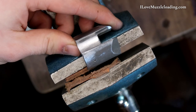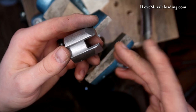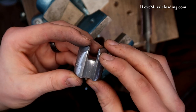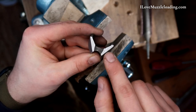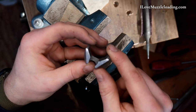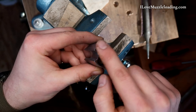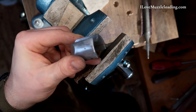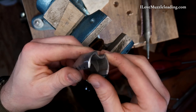I'm going to take care of this off camera and then we'll move on to our next part. So after I cleaned up my nose cap here, I had a few details I wanted to show you — things to consider that you might want to clean up on your parts. I have some rough, nicked edges here from working both sides — you can see right there, we have kind of a gnarled file mark along here. Along our front here, this is going to be visible from the front of our muzzle, so we want to make sure that we're polishing and cleaning up this front face as well. Right now it has just preliminary grinding marks from the factory where they've probably removed some casting gates. I want to flatten out this face between these two ridges, and I'm going to clean up this bottom face too, even though this goes into our stock. I also want to chamfer this edge as it goes around here a little bit, just to give it a little more style — that's something I really like to do.